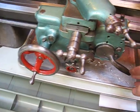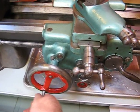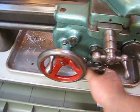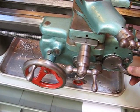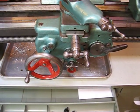The last major function that the apron has is for threading. That's what this lever is. It works similarly to the longitudinal feed, except that it's precision and it doesn't slip. Unlike the clutch-driven power feed here, which can slip — which is an advantage in certain circumstances. This reduces the likelihood of damage.